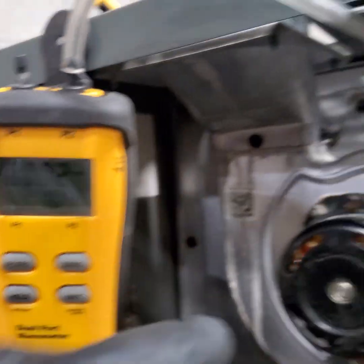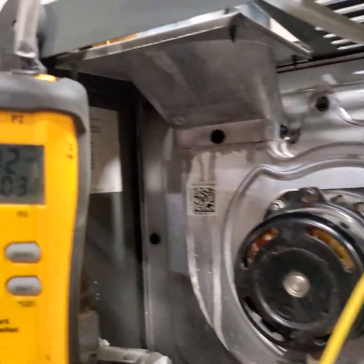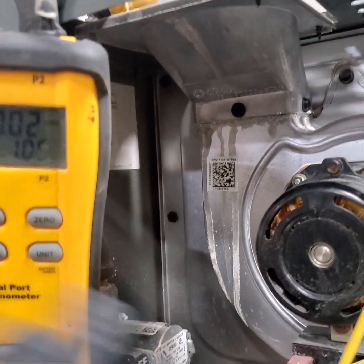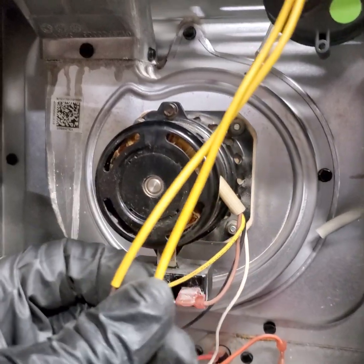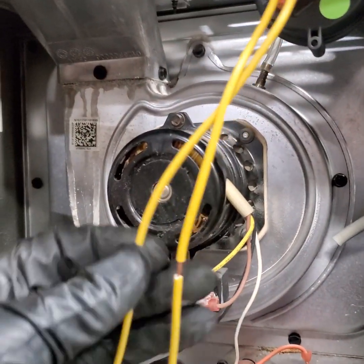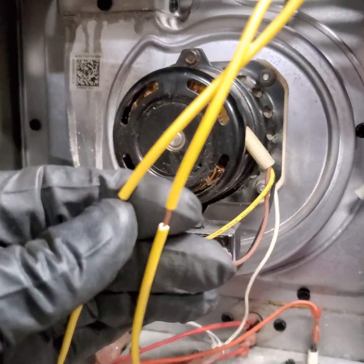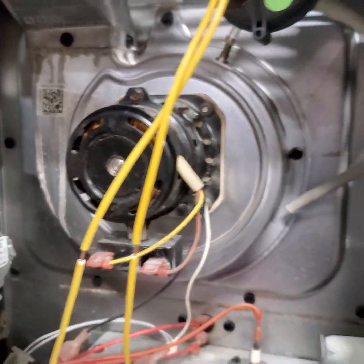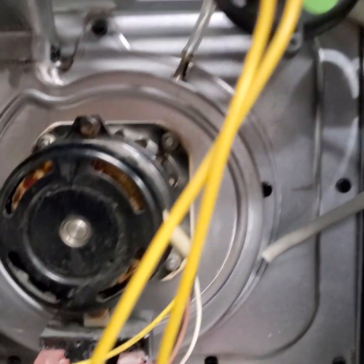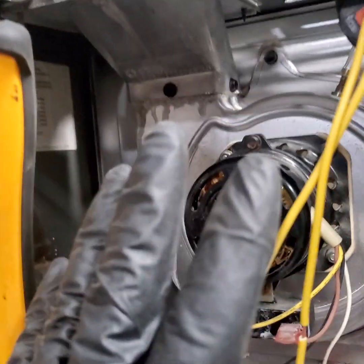In this case, if the pressure switch is not closing, I know the pressure switch is bad, and the exhaust flow is normal. In this case, if it's cold and freezing and I don't have the pressure switch, I can go ahead and jump it manually so they can have some heat. But again, I will tell them later how to do it, or maybe I can tell them you can have heat only for now. Make sure it's like 80 degrees, so by the morning, it's going to be barely 60. So they can survive. Okay? So that's how you see.